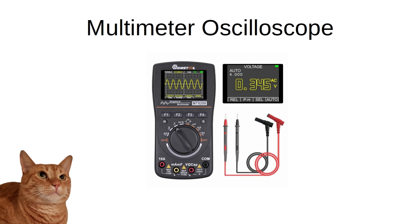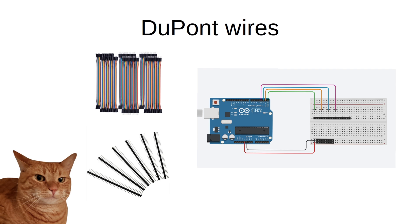Another good tool would be an oscilloscope, which can be used to test whether or not a pin is supplying pulse width modulation — otherwise known as PWM — and show you the resulting waveform. You can save a few bucks by getting a combo tool that can do both, although I'm not sure how great it is at doing either because I haven't personally tried it. Another good thing to have on hand are DuPont wires, which can be inserted into the pin headers of the MCU and used to test the pins more safely than trying to cram multimeter leads into a tight area and potentially short something out. Another way to spread things out a little would be to have a breadboard handy and use insertable header pins to give yourself test points for each of the pins on your MCU.